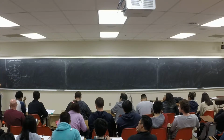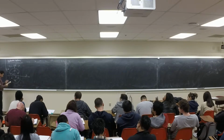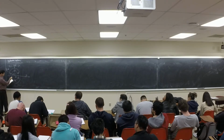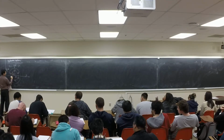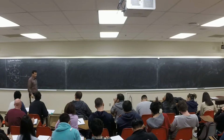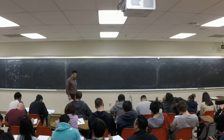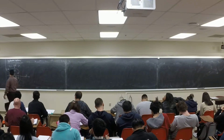So now I'm going to put another winding here, right? So this one will be not here and not here. I'll call this one F and F prime. F stands for the field, you know. So we put this field winding on the rotor. So let's see how the magnetic axis is going to be for this one.